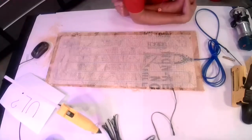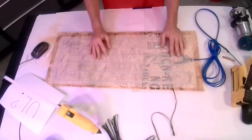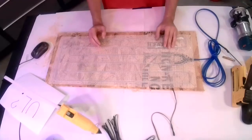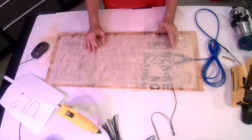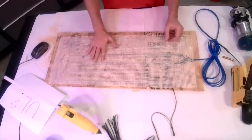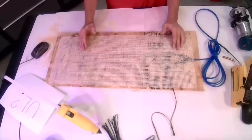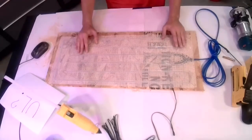Yeah, I do see one question, I'm assuming there's more in the back, about whether it can heat the entire space as a primary heat source. And as Bill had talked about in the beginning, it's a great part of a heating system mix, but if you're in an extreme climate, it will probably be a good supplement. The mini split, which works like a heat pump, can only heat so much depending on the temperature differential, so it can be a great thing to go with that. It really all depends on your environment, but even more so your insulation. And if your tiny home is built to the building code in the area where you're using it, the insulation should meet appropriate conditions for that.